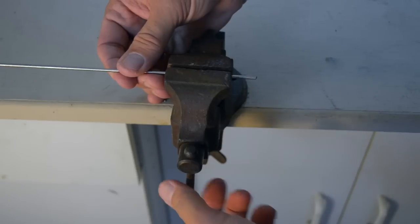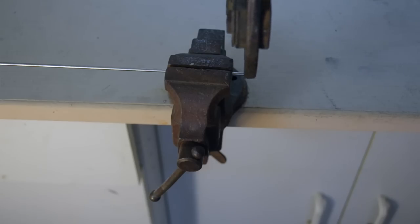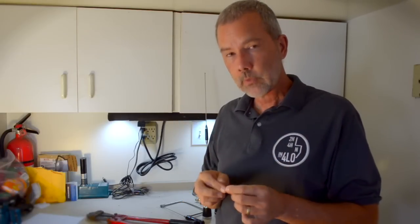Put on your cool-looking eye protection and put the antenna in your vise. Get your cutters and start cutting — only tiny little sections at a time. You probably can't even see the section I just cut; it's half a centimeter or less. On UHF frequencies, which is where GMRS runs, one tiny couple of millimeters can make a huge difference, and cutting it just a tiny bit too short can have a huge impact. So go bit by bit — cutting, measuring, cutting, measuring — until you get down to as close to 1.0 or 1.5 SWR as you can get.